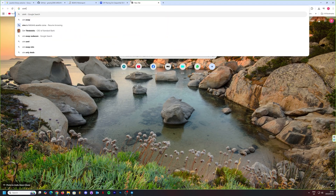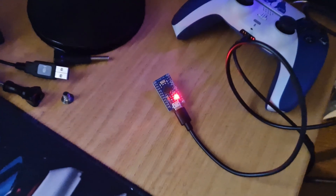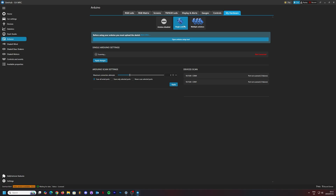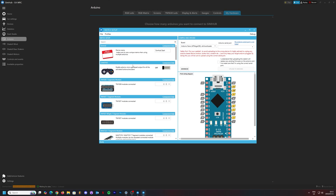Time to program your Arduino. The first piece of software we're going to need is SimHub, and the beauty is you do not need to know anything about Arduino — simply download SimHub and connect your Arduino to your computer. Once connected, go to the Arduino section, under Single Arduino, and open up the Arduino Setup Tool. A pop-up will appear where we need to tell it what board you specifically have bought — go ahead and select your type of board from the drop-down.